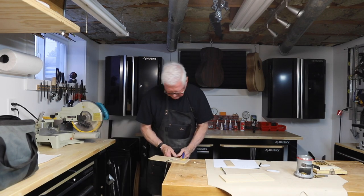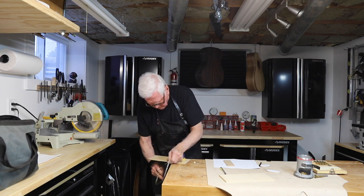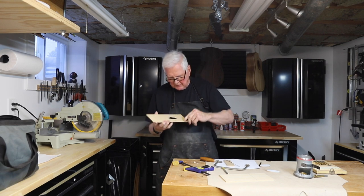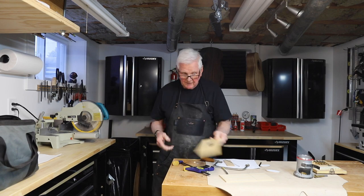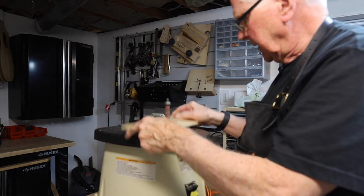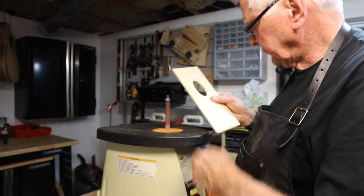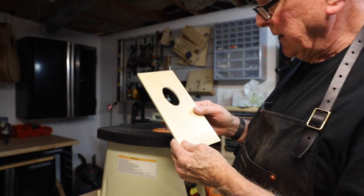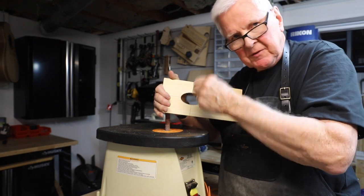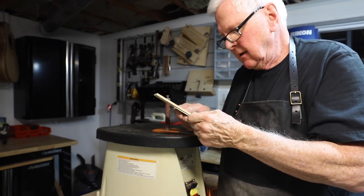The coping saw — take the blade out. There we go. What we have now is our rough cut, and what we'll do is take it to the sander and round this all out. This is working fairly well. We've got our rough cut, and we're going to cut out to the line and make a nice oval shape. There we have our template with the oval cut in it. I'll sand all of this smooth with fine sandpaper and bring it right down to the line, and use a file to take the little burrs off.